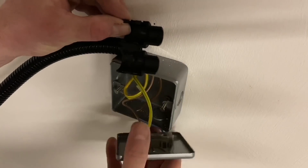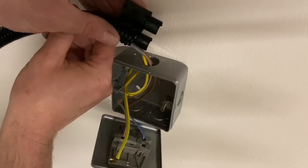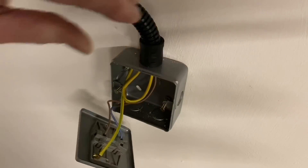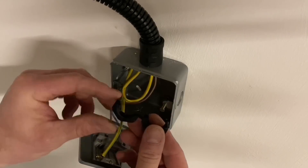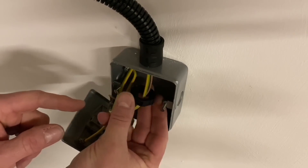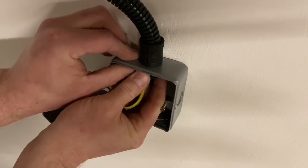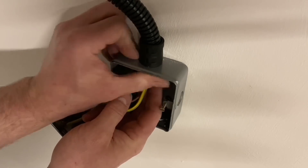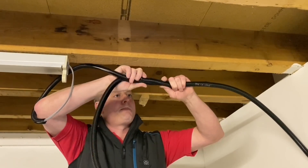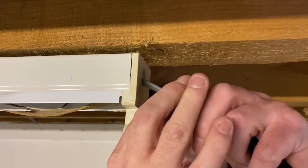Put the twin-and-earth cable into the smaller part of the slit conduit system - there's something quite satisfying about clipping the two together. The slightly larger one goes on top, feed it down with your hands, then do the same on both ends. Click the gland down into position, fit the split gland, click it together, introduce the lock ring going around all the cables, and tighten it off. Then dress it round to the required length at the other end, clip it together, and push it into the fluorescent fitting. No connections have been removed.